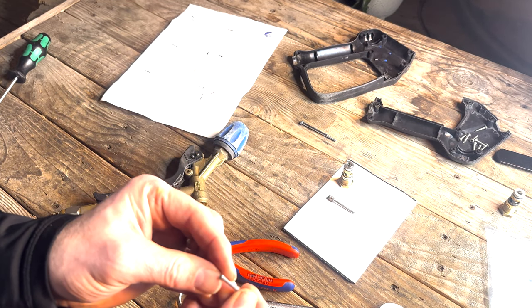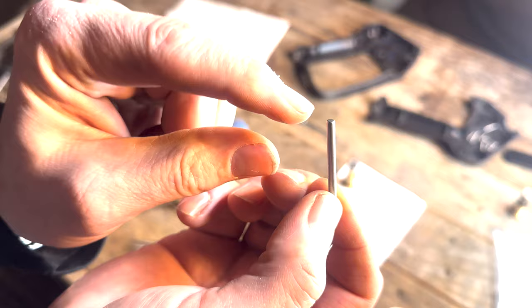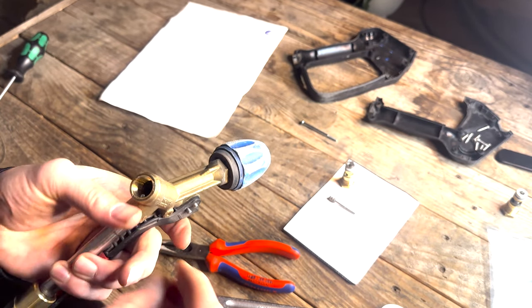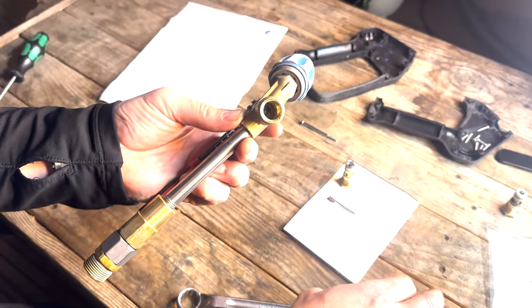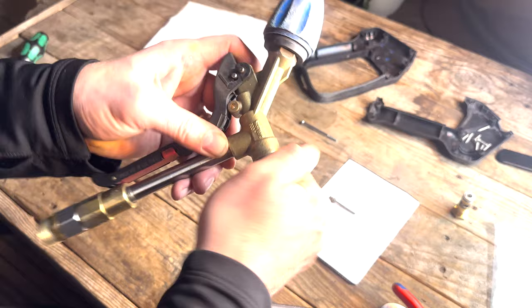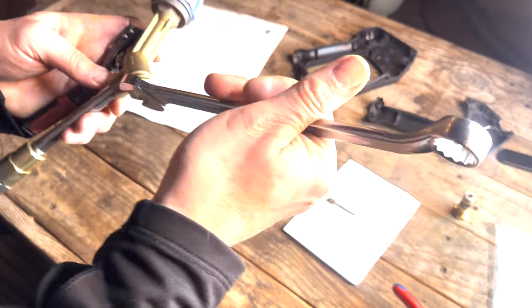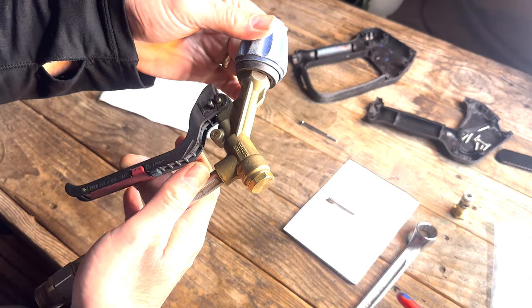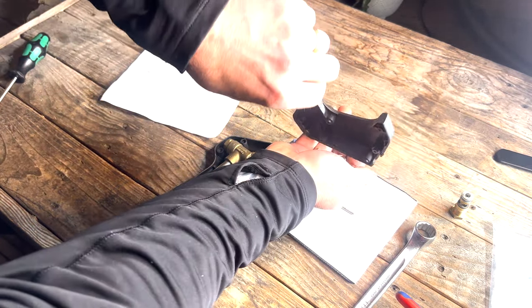So the pin — there's two ways to go on the pin. There is a little divot on one side; that's where the ball would seat, and that's where the pin would be pressed by the trigger. So drop that in, move it along with pliers to get it right down that hole, push it all the way through. Then get the new valve assembly — it's all got the o-rings, everything in it. Screw it all the way up. It doesn't have to be really, really tight because it's sealed on o-rings, but just need to give it that nip. Make sure the trigger is pressing — which it is. And then literally all we have to do now is screw it back together.